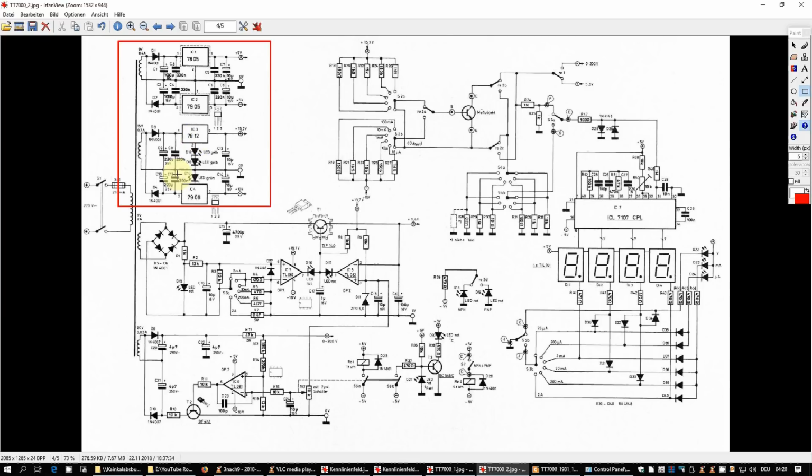You might wonder why for the negative base currents we have only minus 10 volts. Well, that is because for PNP transistors, this is measured relative to the plus 5.7 volts, which becomes the emitter voltage. So in fact, this is then used as minus 5.6 volts. And if you add this up, minus 10 and minus 5.6 gives again minus 15.6 volts.